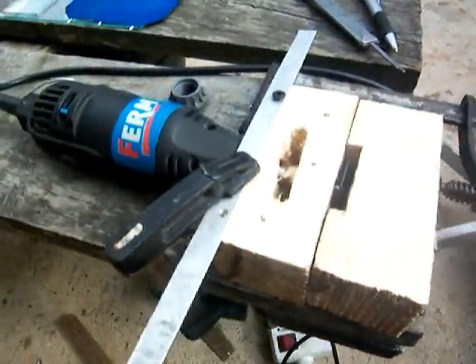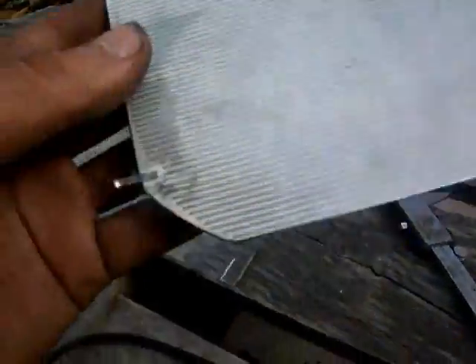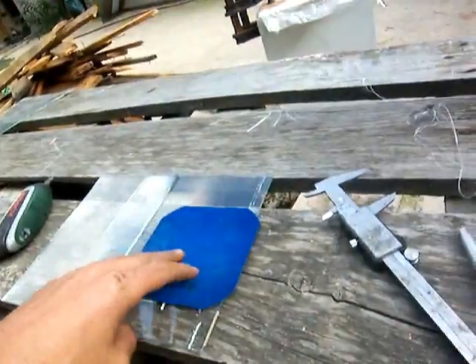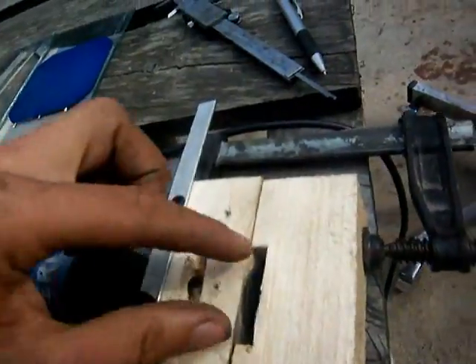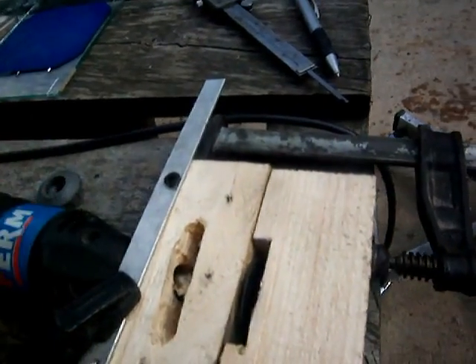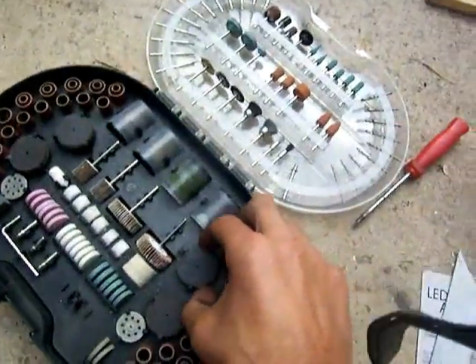I quickly made a table to cut solar cells — my beloved SunPower cells. I did shortcut it here with thin solar so it's worth a try. This can easily be unscrewed, and then I simply drilled a hole 80 millimeters so I could screw in the angle grinder, and we have a one millimeter disc like this one.